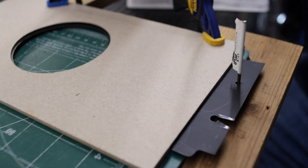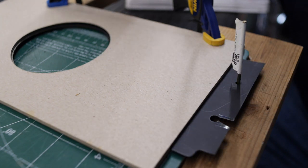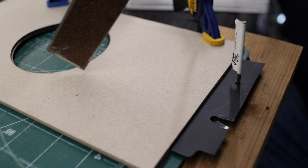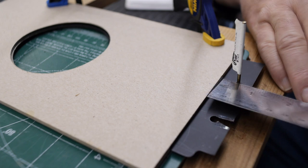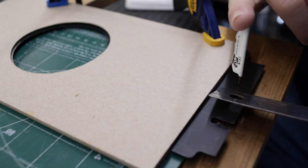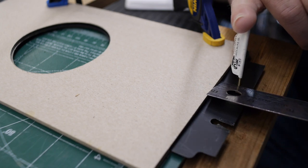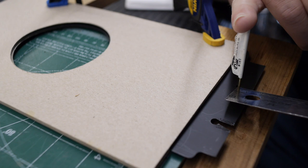Okay, so I have the stopping shutter cocked, and with the opening in the stopping shutter centered onto the opening in the shutter holder, the distance from the edge of the cardboard holder to the holes that need to be drilled is about 14 millimeters, it looks like. So 14 millimeters from the edge of this cardboard to the center of these holes.